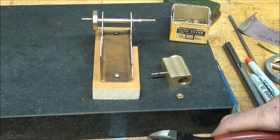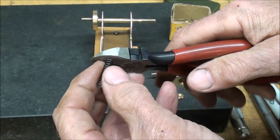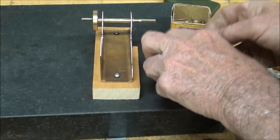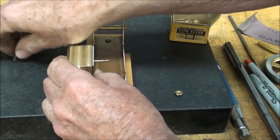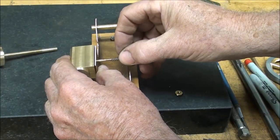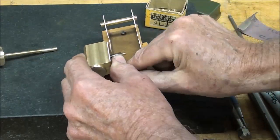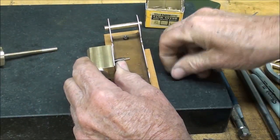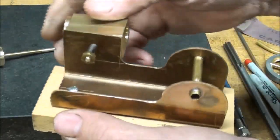From your selection of springs or what you have at your hardware store, you need a spring — kind of a light wire, almost something like a ballpoint pen spring might do. I'm going to cut this off so it's one inch long. I had some 5-40 brass nuts, but where are you going to find those? You can put that on like that, and you might use a washer here, but I don't think you need one. Or perhaps you want to make a little knurled nut for better appearance. And that's the pivot point.